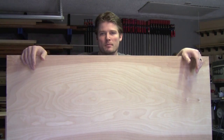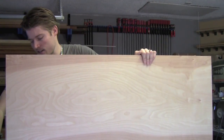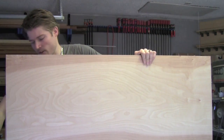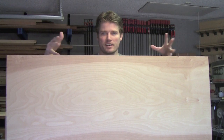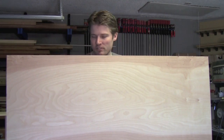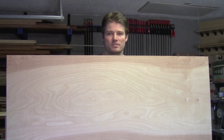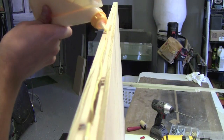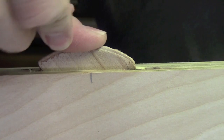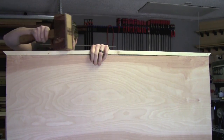I've got the panel up on my table saw cabinet and I'm going to glue the edge banding on now. A little tip: if you're ever gluing something on edge like this and you need it to stand up by itself, get a quick grip clamp and put it on the bottom edge over here on the corner. It has a wide enough surface area to keep it propped up so it doesn't fall.